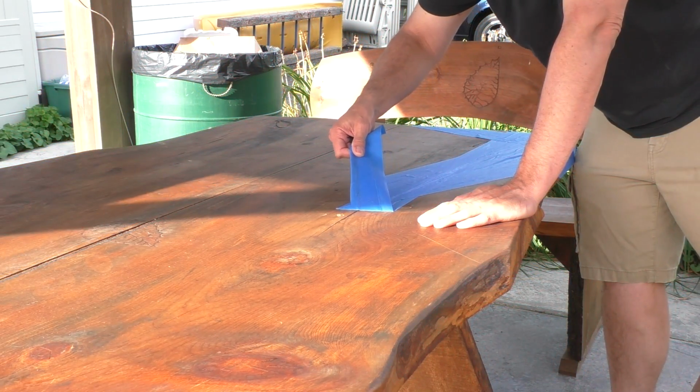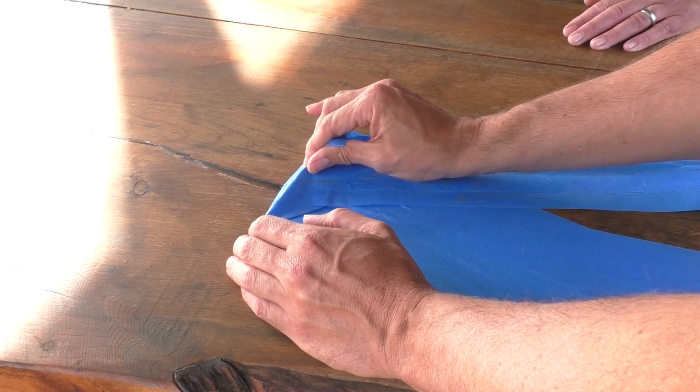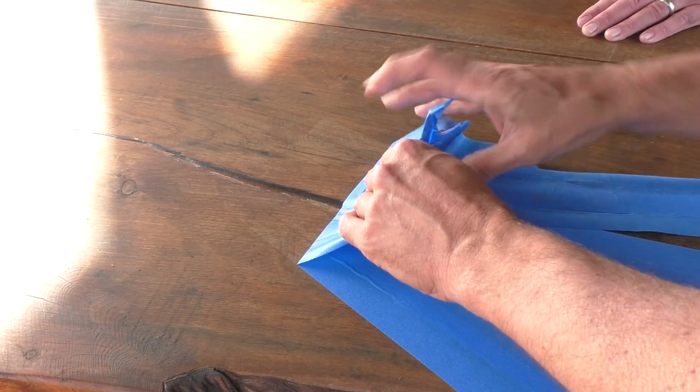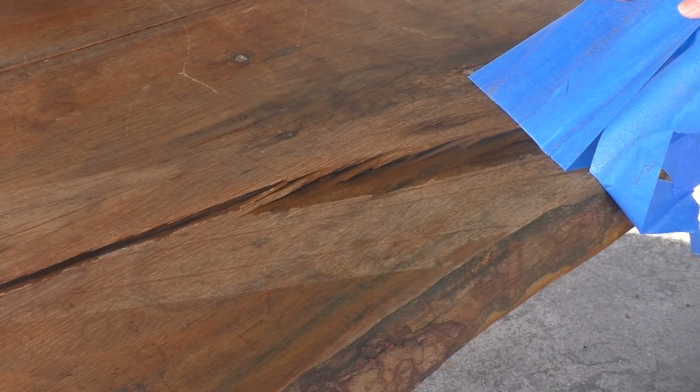The next day, I was getting ready to come back to Cleveland. Even though the epoxy had only cured overnight, we couldn't wait to peel the tape and see what we had. Honestly, it looks pretty great. Not only did we fill in the split, we also smoothed out the height difference between the main tabletop and the part that's splitting away.